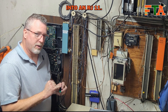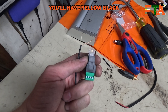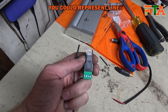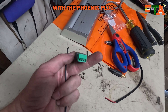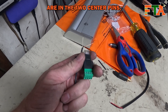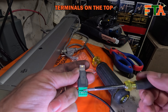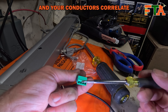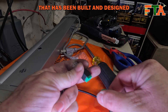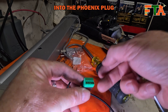This is a Phoenix plug into an RJ11. If you look at an RJ11, you have four conductors inside - red and green on the two center pins, yellow and black on the next two pins to the left and right. So there's a total of four conductors in this plug. In theory it could represent line one, line two, or signal one and signal two. When dealing with the Phoenix plug we also have four conductors. Since red and green are on the two center pins of the RJ11, we're going to put our cable on the two center pins on the Phoenix plug. On a Phoenix plug you have screw terminals on top that loosen the openings in the back where you put your conductors, and they correlate to whatever is on the other side. This RJ11 adapter has been built and designed to plug directly into a Phoenix plug, so we'll simply insert our raw wires into the Phoenix plug.